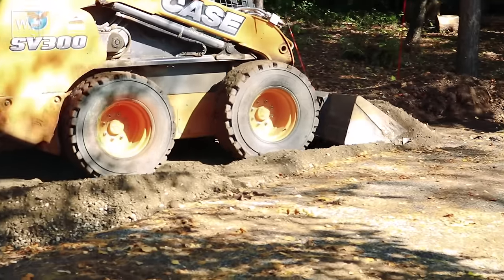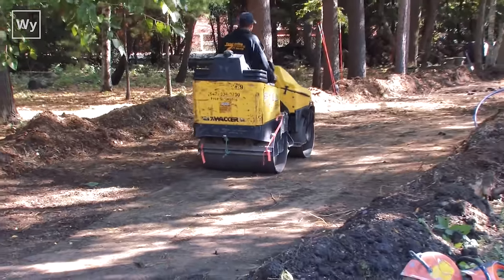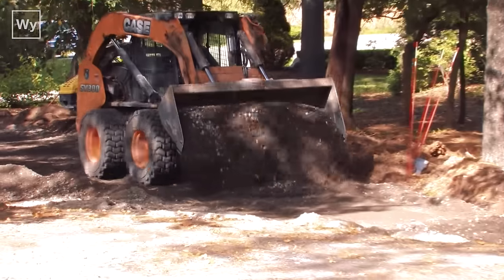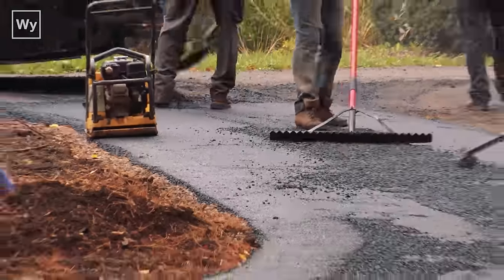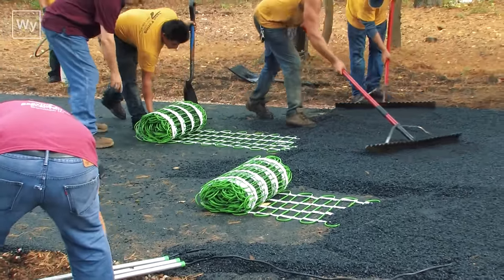What we've done now is we've excavated the dirt and taken a steamroller and rolled it down. What's next is about six inches of compacted gravel. They're going to dump it in here, spread it out, then compact it down. After that six-inch layer, we're then going to put a two-inch binder coat, put the heating cables over that binder coat, and then put a two-inch top coat on top of that.